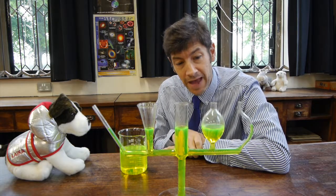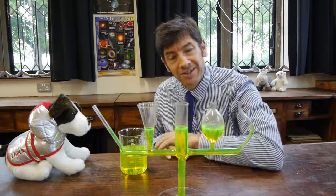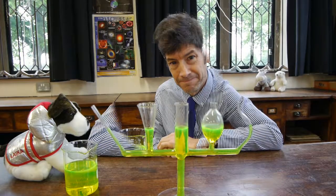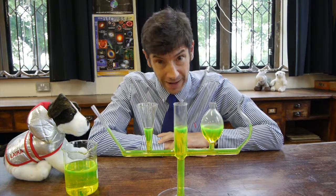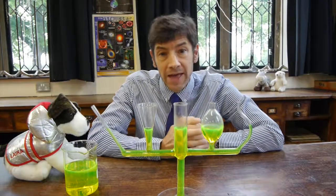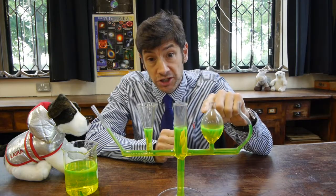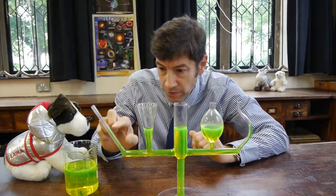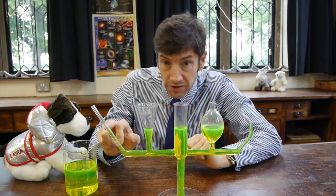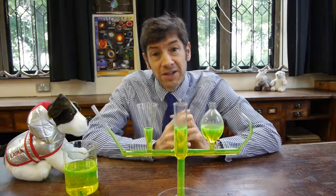Once it's settled down, you'll notice something rather strange: all of the levels are identical in all of the vessels, and this is going to take rather a lot of explaining. All the containers have the liquid at the same level. To get you thinking about this, I'll show you why it is so counterintuitive. There's a large amount of liquid in this large container and very little in the small one — surely this one has a heavier mass and should push down and squirt liquid out of this thin pipe. But it doesn't. They all find the same level.